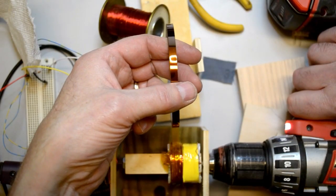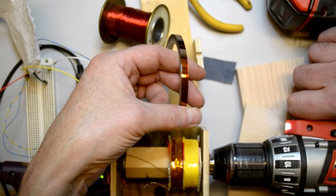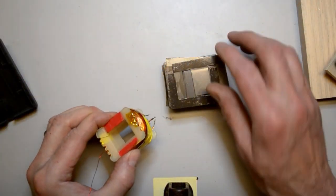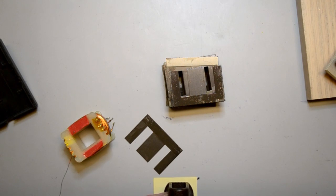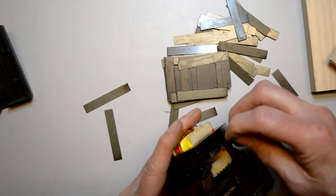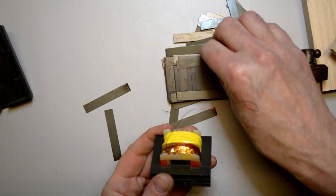After the coil was wound, I taped the entire primary side with several layers of tape. Now it is time to reinstall the core. I was surprised how the bloated primary coil came back to haunt me — the E-laminations fit the coil form very tightly. Because the primary winding stuck outside the coil form, I had trouble putting the first E-lamination in. The winding was a little squishy, so I was able to compress it using a small vise to install the first few E-laminations. Those compressed the winding enough that I could finish installing the E-laminations. They are installed alternately to maintain a continuous magnetic field. The last two E-laminations were difficult to install because they were so tight, and I had to compress the core and get creative in opening up enough space.